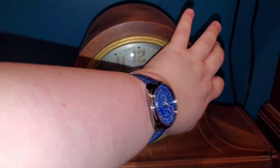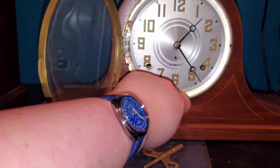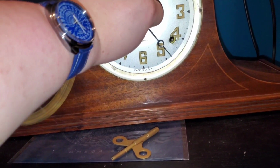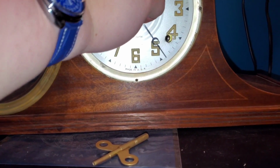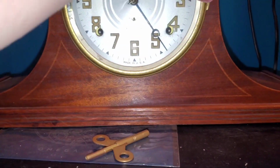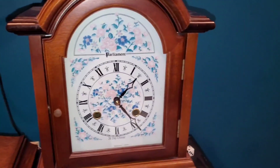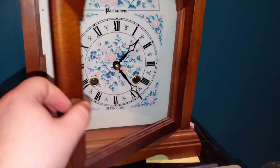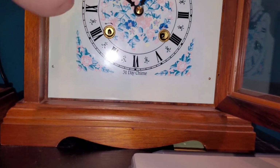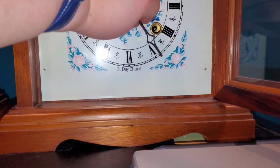Contrary to that, this Plymouth from the Seth Thomas Clock Company has rack and snail striking, and it's a quarter striking clock with instructions that specifically state to push it back to set the time, so it's perfectly safe. And this Korean Parliament Daejeon bracket clock can also go back. Yep.